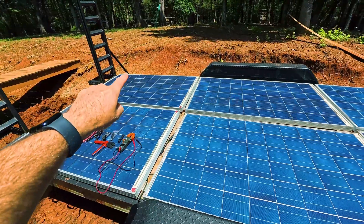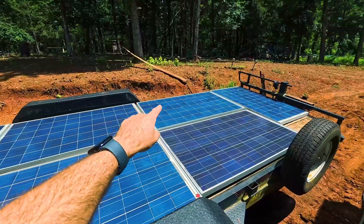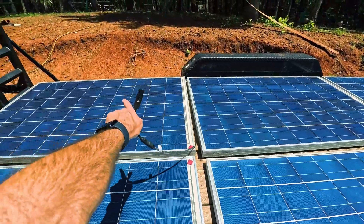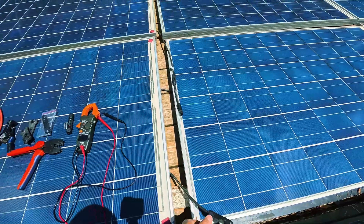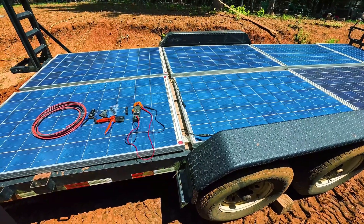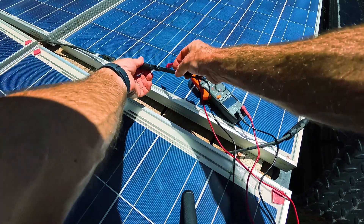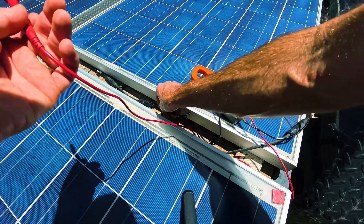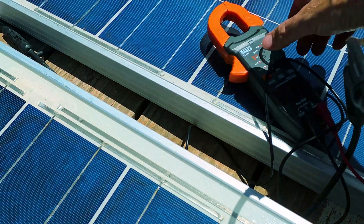What I've got is the panels start right here. They're connected one to another, which is in series. This one connects all the way to that one, connects to that one, connects to that one and back around over here. Once we've done that, this is where we're going to connect — this far panel and this panel here. So once you've got them connected together, the next thing we need to do is measure how much voltage we have going into each of these. We've got the voltmeter turned on to volts DC. I'm going to plug this one in here and you want to be careful because as you plug this in on one side, you will get the voltage out the other side. This guy's plugged in here and this one I'm going to connect in here. You can see there's a little barrel in here that you're going to plug that into and connect it.